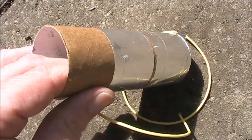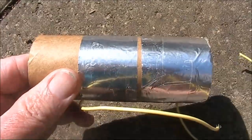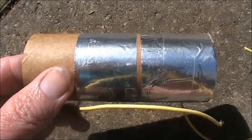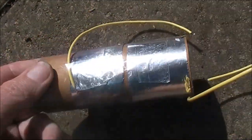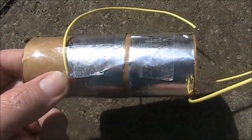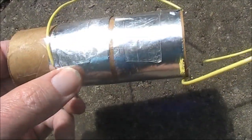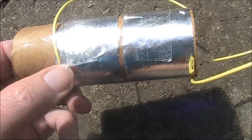And so that's how I came to make this toilet roll variable capacitor. There are two strips of aluminium foil, separated by about 3mm. Because you can't solder to it, I've just put in some insulated stranded wire — you can just see it underneath — and put it under a winding of foil, using sticky tape to hold it in place.